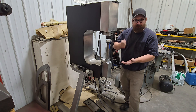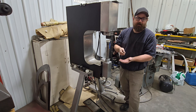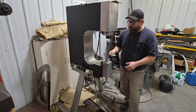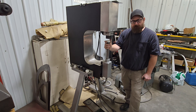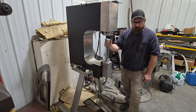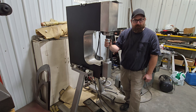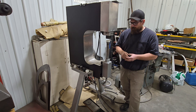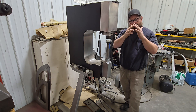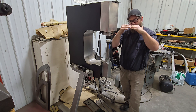With a hammer, I would suggest you not swing it. Find a heavier body hammer and just let the weight of the hammer drop, taking the variable out of swinging. The lower die here is concave — this is a concept. The first guy I read about on forums who did it this way was a gentleman by the name of Daniel Gunderson. He created a thing called a donut dolly, and that's the first reference I saw to it. That lower die being hollow gives it room to come down to the point of spring-back and spring back to flat. You need to push it just past so the spring-back comes back up to flat.